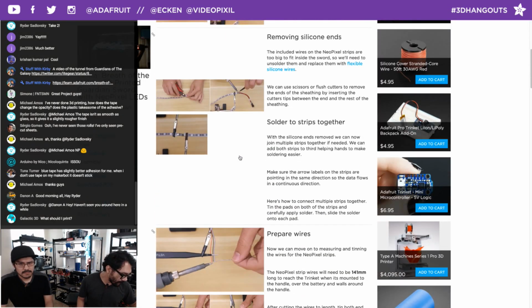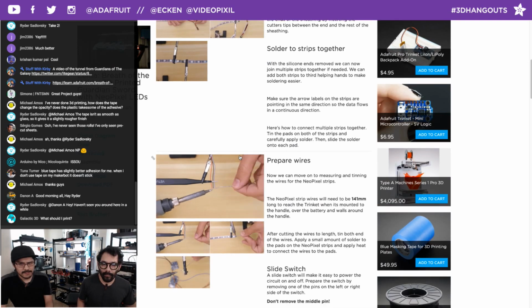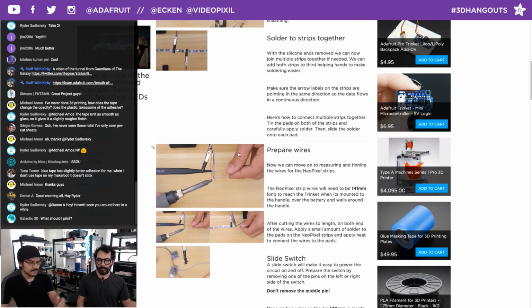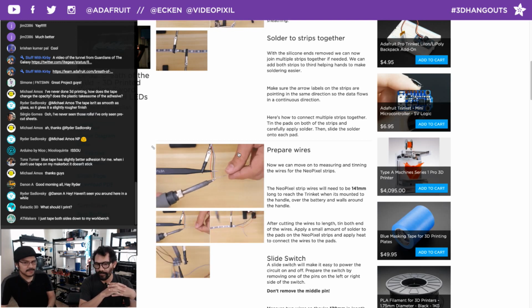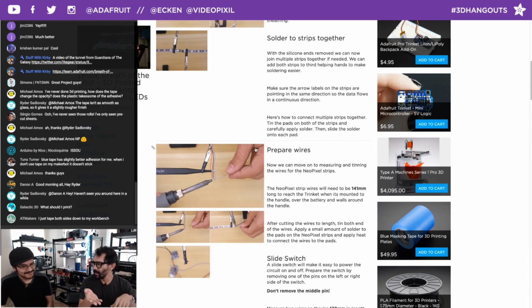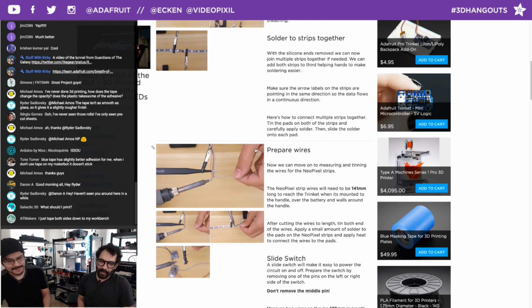Next thing: silicone coated wires. Silicone covered stranded wires, super long name. These are great wires. They have good heat resistance, so when you apply heat to the wire, it's not going to curl up or shrivel up. In every project that we use, if the component already includes a wire, like the speaker, immediately take them off, because they probably are not going to come with a very fancy silicone wire already on there.